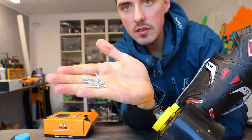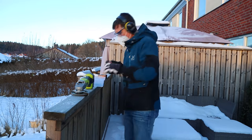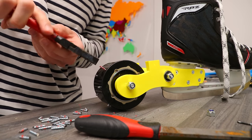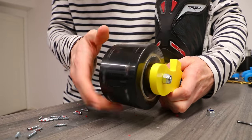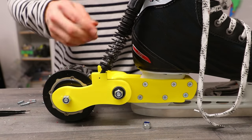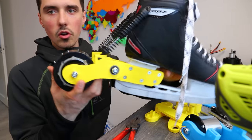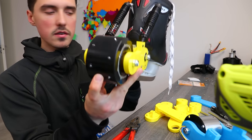These are the studs. Let's put them in and see how well they work. I started with a modest 32 studs, 16 on each wheel. Cutting them was a nightmare, but in the end they all looked something like this — pre-drilled and just pushed them in. It worked because of the aluminium frame stopping the studs from going further in. I was pretty sure this wasn't going to be enough metal-to-ice contact, but still wanted to give it a try. I couldn't compress the springs to the level I wanted; the plastic fabric part flexed enough to render the springs pretty much useless. I had a suspicion this was going to be a problem. So that's one of them fully assembled — not sure if it's enough studs, but we can always add more later.